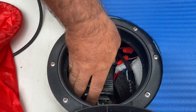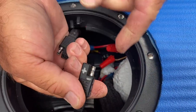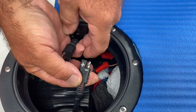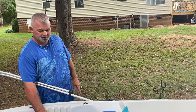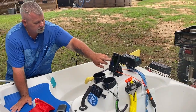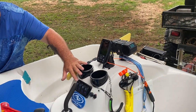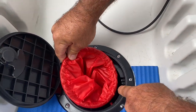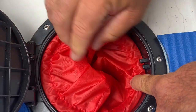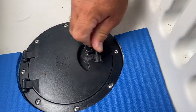Here's the battery — it's located in where I cut the foam out. This connection is an SAE connection. You can unplug this, and I got an adapter that plugs here; this goes to the battery so you can hook it to your charger and charge the battery without removing it from the hole. This battery is strictly dedicated — 14 amp hours — to run your sonar, all of your features, the anchor light, the nav light, the underglow LEDs, and the spots. I'll show you how to put this back in without breaking it. You see the bottom little clip? You slide this ring under — that holds the ring — and then you turn it and it's locked.